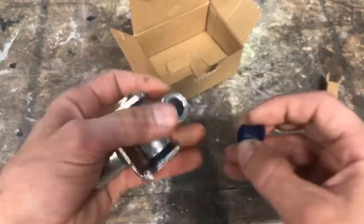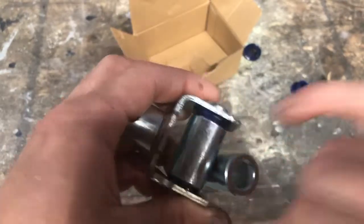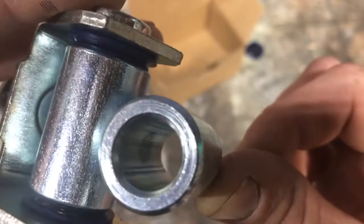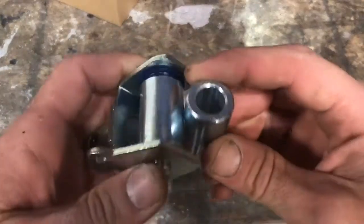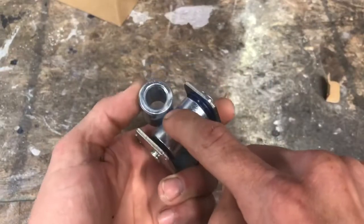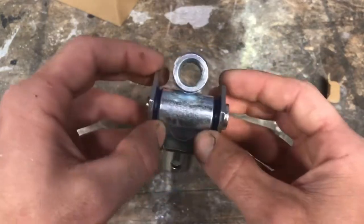Notice that these will pop out of here — I don't want to melt them — so what I'm going to do is get into that corner as best I can and weld it better. If you look on the inside it's kind of tough to tell, but they did get some penetration in there, but man, that's just not a very big weld. Before I start welding, I don't think it's a good idea to weld with that coating on there, so I'm going to get in there the best I can with some sandpaper. To keep from melting the plastic bushings I have a wet rag that I'm going to use to try to sink the heat out near those bushings so it doesn't melt them.